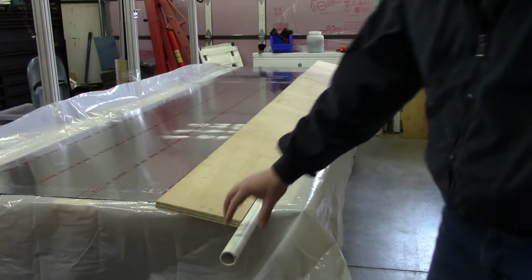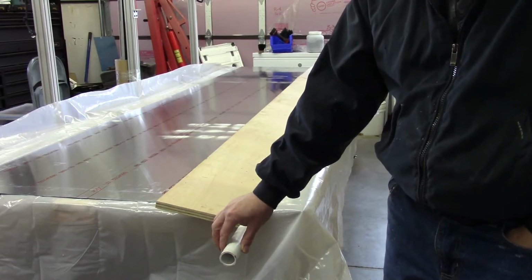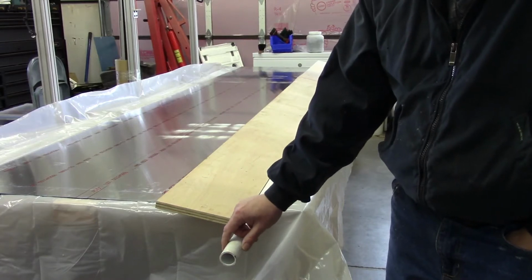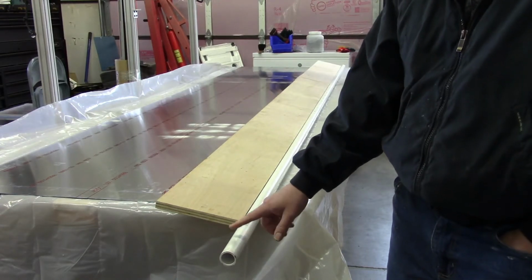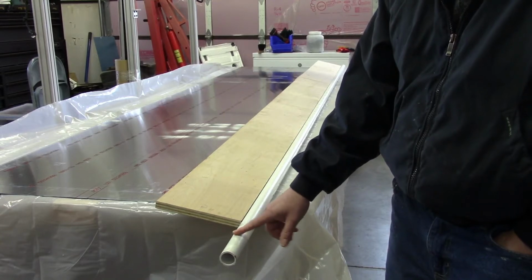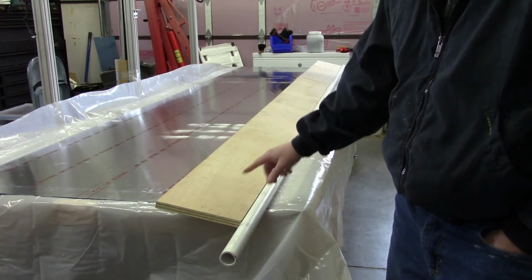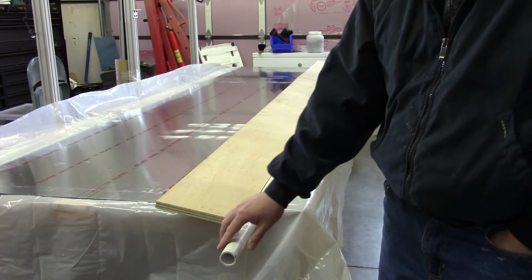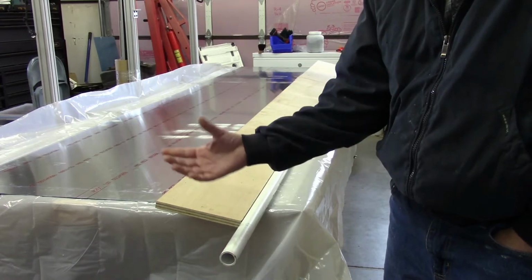So this is my take on how I wanted to handle the form that will help create the nose on the nose rib. Now this right here has an outer diameter of 1.325 inches, PVC. As I mentioned earlier, a lot of people in videos that I've seen demonstrated will use Schedule 40 pipe, and the concern I had with that is that even with a steel pipe, you're talking a very long length using a very thin piece of pipe, and there could be a tendency for flexing.